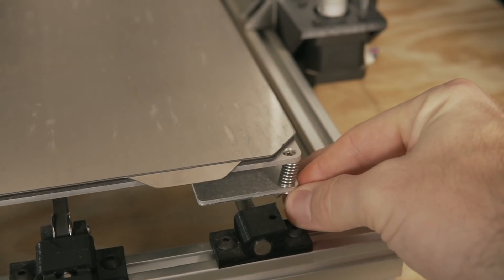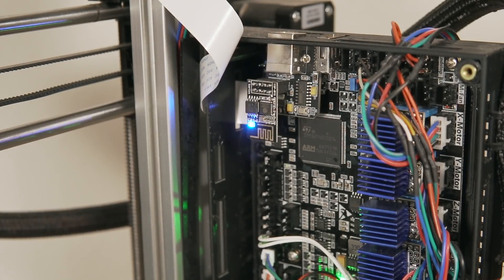Overall I am quite happy with the end result, but if I were starting this project from today the components I would have used would be completely different. The main thing I'd really like to upgrade is the extruder, and it is still a 12-volt system — which is what the original Anet A8 was — and I have been super spoiled by 24-volt systems, which have almost become the standard for nearly every 3D printer I've gotten since. Bed heat-up time for PETG at 70°C ends up taking around seven minutes, which compared to some of my other printers that hit that in roughly three minutes is a little bit annoying.